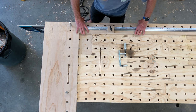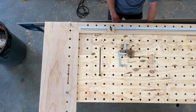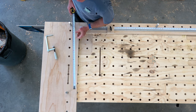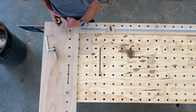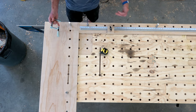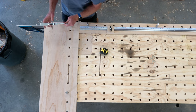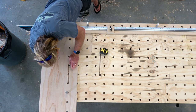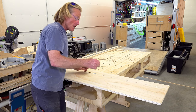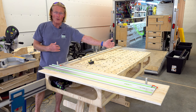For the rail that sets how long the piece is and makes sure it's square to the track, I do the same thing — a few more bench dogs. On my smaller bench, I can go up to about 26 and a half inches before I run out of bench dog holes to square it up. If I want to go wider, I drop that bench dog in, get everything square — I don't need to calibrate that. Putting those bench dogs in place squared me up. Once this is squared up, I take a clamp and clamp it so I know it's square. Then I can pull this bench dog out, relocate it to however wide I need to go to do 48, and my track can have enough spacing for the wider material to go through.